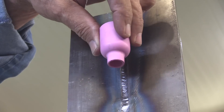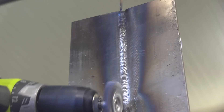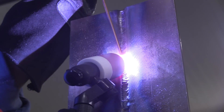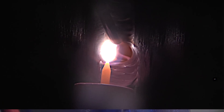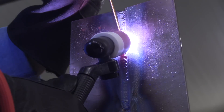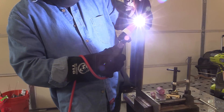Now let's go to the third pass walking the cup. I'm switching over to a number eight cup, now that I'm out of the bevel groove. While it's still good and hot, I'm going to give it a quick rundown with the wire wheel at low RPMs and get right back in there for that third pass. I can kind of tell I'm going to need one more pass after this one — it's just barely above flush in some places and probably a little bit under in others. That's also a reason why you don't want to come very far outside those bevels — I'm just barely nipping them right here.